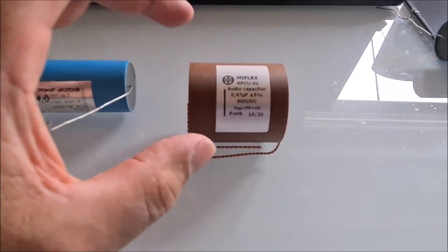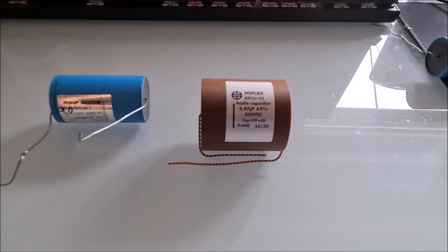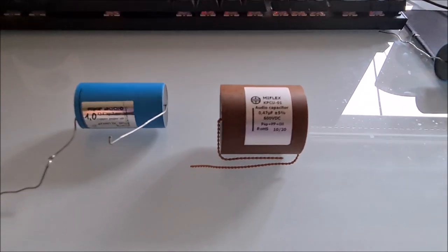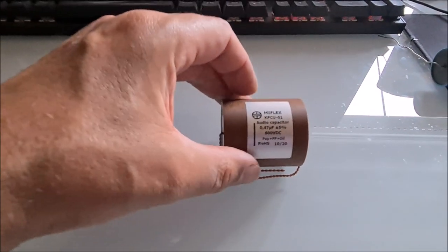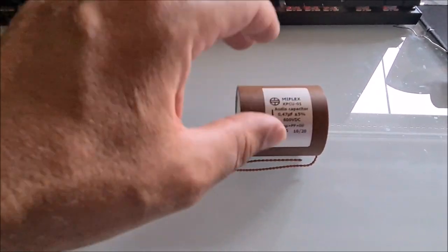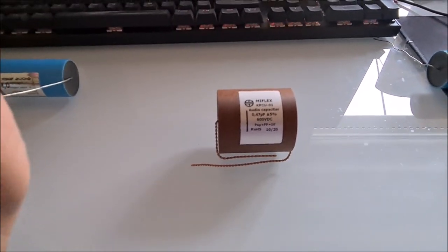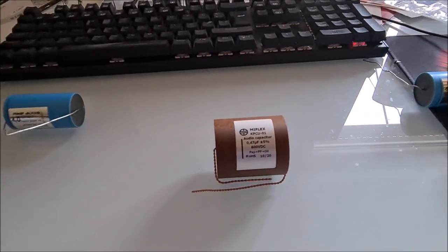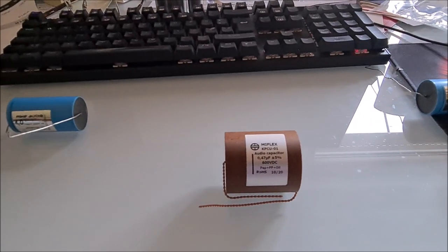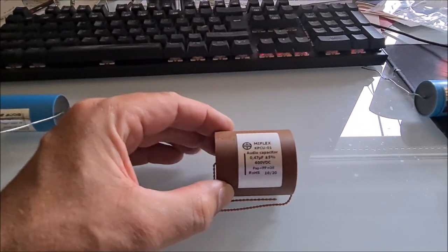The first thing I thought of is separation and depth. And the second thing is color, realistic colors of the instruments. And for me, the most important is space around the instrument. This is much better with this one here. And I have to say, nobody will believe me, I think, but it's true. If the tweeter is right, with the right cap and with no torsion or pressure in cabling and in the build quality of the tweeter, the complete speaker in the full range is a completely different league you will reach with only the better capacitor for the tweeter.